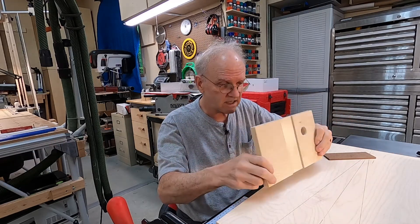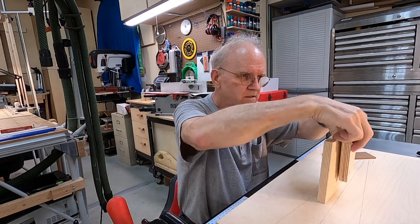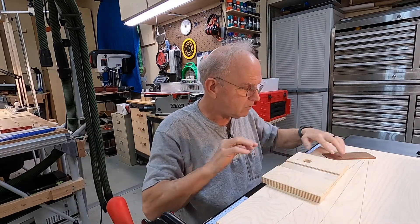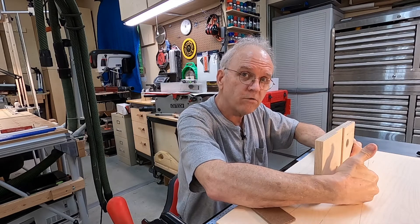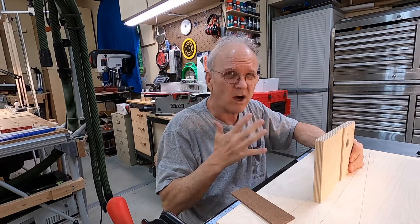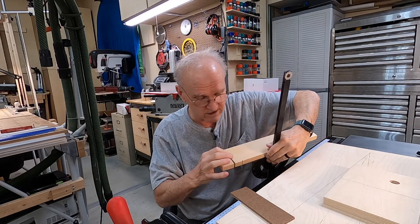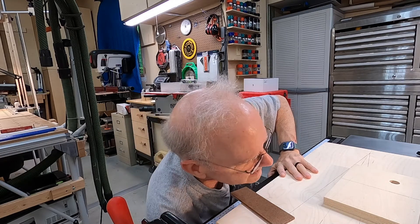The fence is going to be six inches high because your boards will be mounted vertically and clamped down — a drawer side board could be quite tall. You want a zero clearance fence — you'll cut a kerf through your board and through your fence, and you can refresh it from time to time because the zero clearance always gets worn. You can see this miter gauge here is no longer a zero clearance — it's been wallowing around.